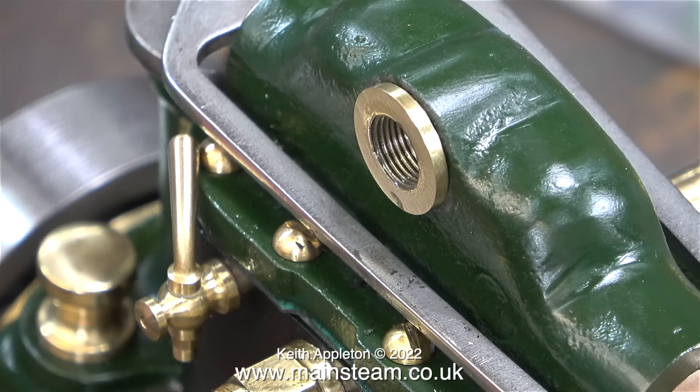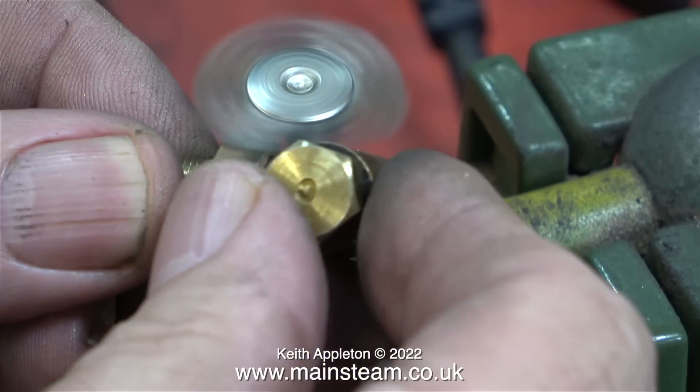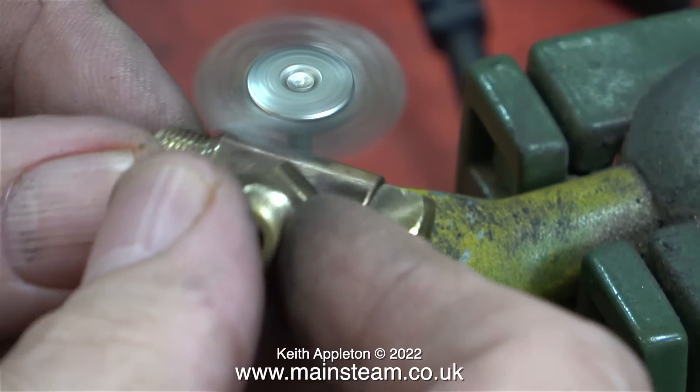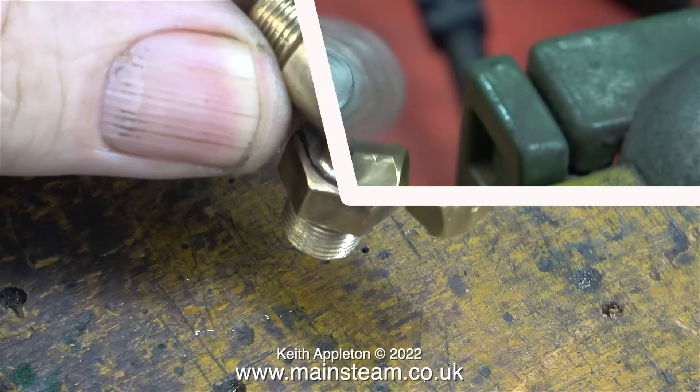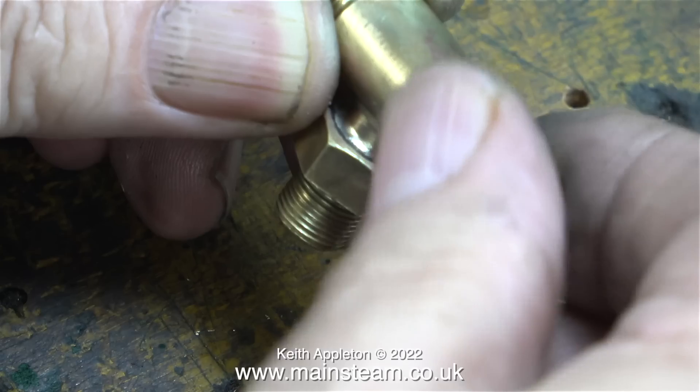Here's the story so far — the thread adapter is now fitted in place. I don't want this fitting to be black, so the best way to get rid of the paint is to soak it for a while in some cellulose thinners. This powerful solvent soon softens the paint, and here I'm removing it using a wire brush in my bench-mounted Proxxon motor tool. After a few minutes of wire brushing the check valve looked like this. I notice I've missed a ring of paint around the silver-soldered area near the hexagon — I'll deal with that later.